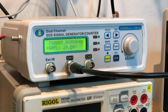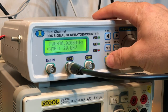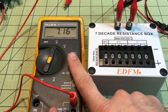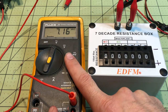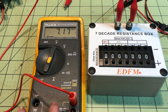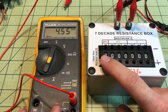I've got my function generator set to sine wave, with the amplitude at 20 volts peak-to-peak at 60 Hz — that's what we use in the field. We want to halve that, so the peak is 10 volts, and the RMS is 0.707 times that, which gives us approximately 7.1 volts RMS on the meter. So we're looking for about 3.6 volts as the split point.